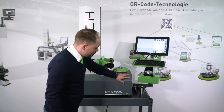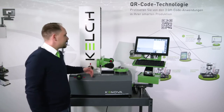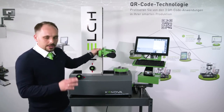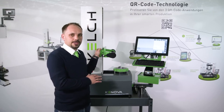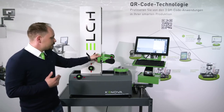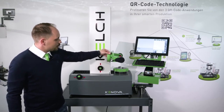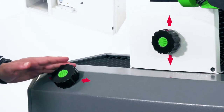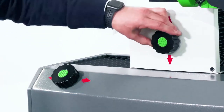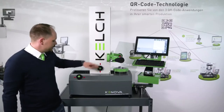With the KNOVA SETLINE V345, we have measuring ranges of 400 millimeters in X and 500 millimeters in Z. This is a complete manual pre-setting device — we move the axes manually and make the measurement manually. For ease of use, we have quick adjustment on the handle for quick axis positioning. And if we need fine adjustment, we have an endless fine adjustment over the complete measuring range, using these fine adjustment bars.